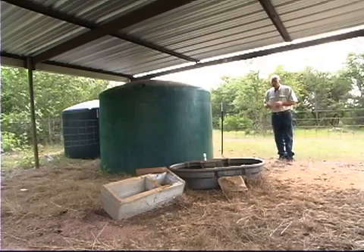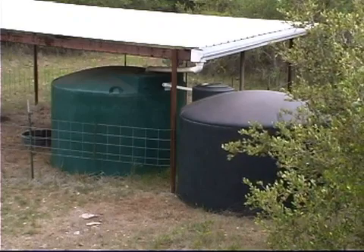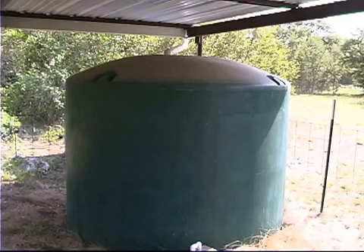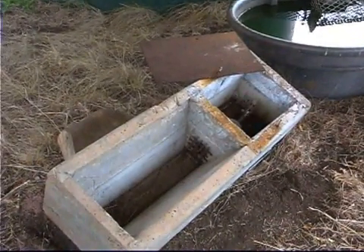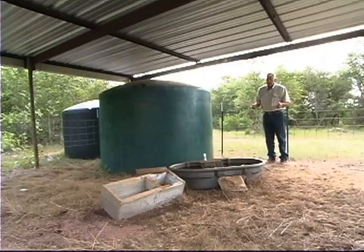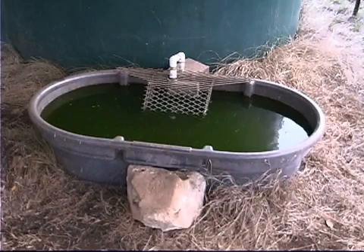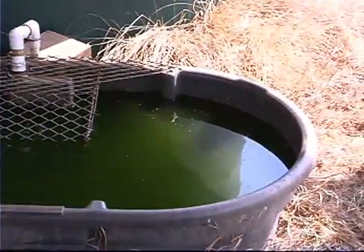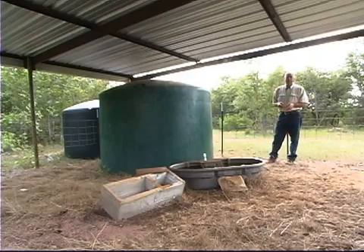There are four ingredients to look at in a wildlife water system. First, we've got to have some kind of surface that's going to shed water off and funnel it into a collection tank. Then we need the storage tank itself, and finally some kind of water trough for the wildlife. It needs to be large enough to take care of the species we're watering, small enough to minimize evaporation, and tough enough to handle a pesky raccoon. But not a feral hog — you just can't design anything tough enough for them; you're going to have to eliminate the hogs themselves.